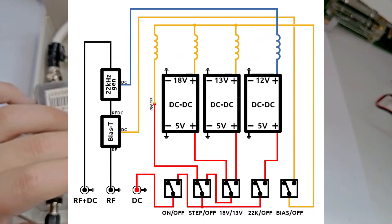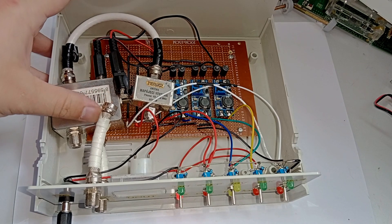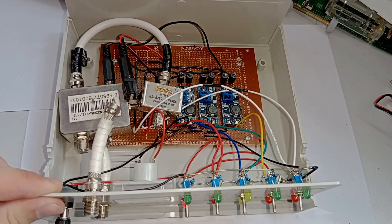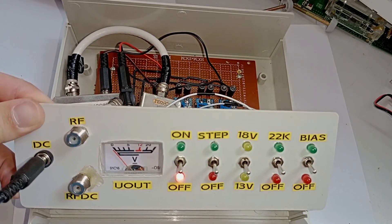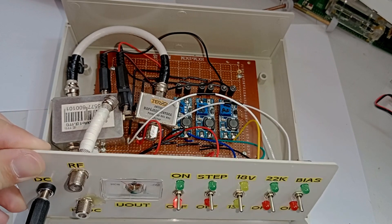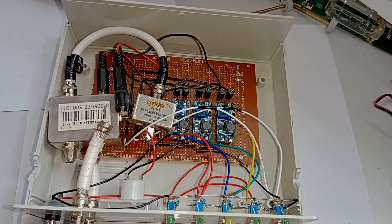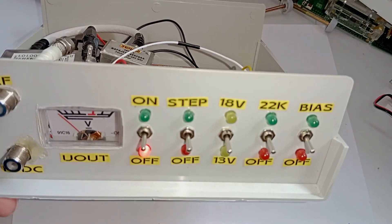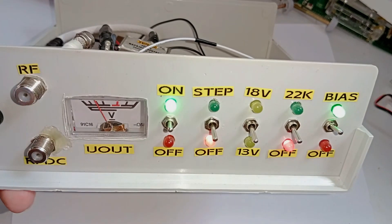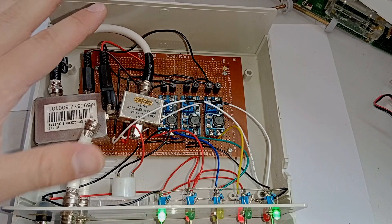That's everything I wanted to show you. Not a very interesting video — you'd be surprised how difficult it is to come up with topics for videos. That's it for this video. I hope you maybe learned something. TLDR: don't use these switches, don't use cheap voltmeters. I'm going to have a future video about how you can build a simple BIAS-T on your own, because obviously not everyone needs all this functionality. Even I mainly use this just as a simple BIAS-T, disabling the step-up converter and just sending five volts from the USB of my computer to power amplifiers for SDR. So I am going to show you how to build a simple BIAS-T — that's a future video topic. Thank you for watching and I'll see you in the next video.